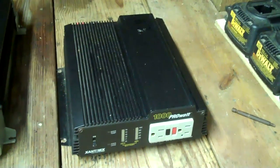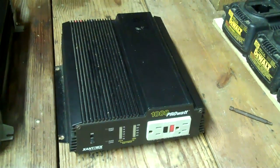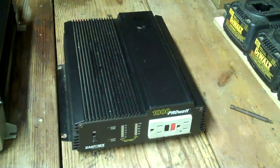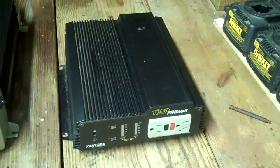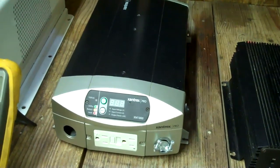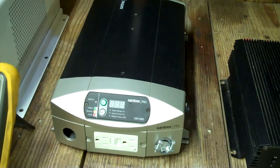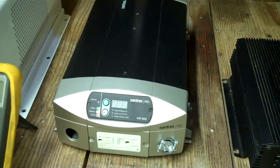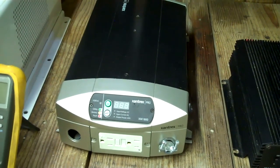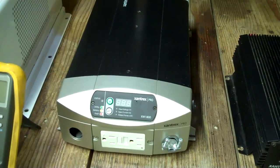The first type of inverter is just going to be a straight inverter — DC in and AC out, just your battery voltage in and your household current out. Next would be what's called a pass-through inverter, which means you have DC in and AC out, and if you plug it into the wall or into the grid, it will switch off the batteries and pass right through the inverter without using or cycling your batteries.